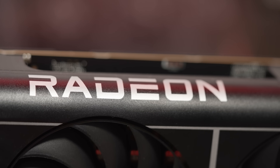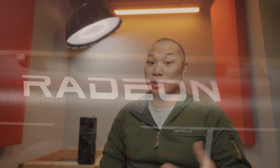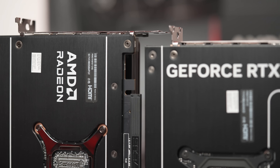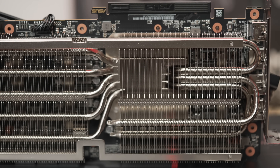For many of you that were successful grabbing a 9070 or 9070 XT, I know many of you were curious about the 9070 tuning, so that's what I'm going to do today. First thing to know is that unlike the 9070 XT, the 9070 is actually already in a good place when it comes to power efficiency. At these power levels, it's less imperative to lower the power, so most cases can handle the 220 or 230 watts out of the box. But if you can, why not? I'll show you how to explore the undervolting potential of your card.